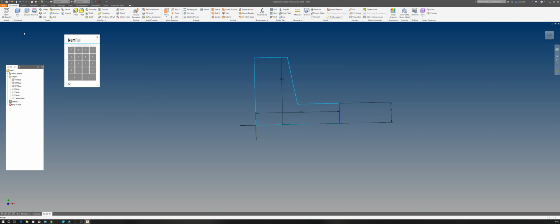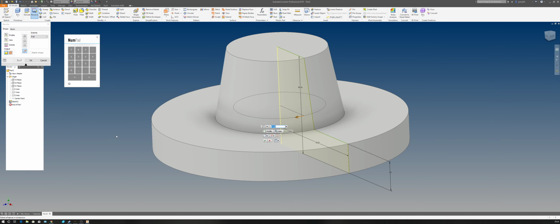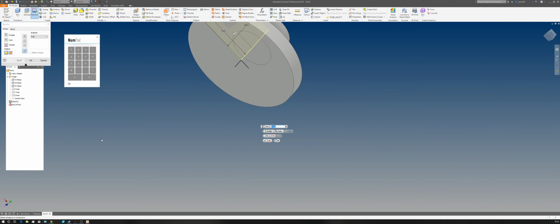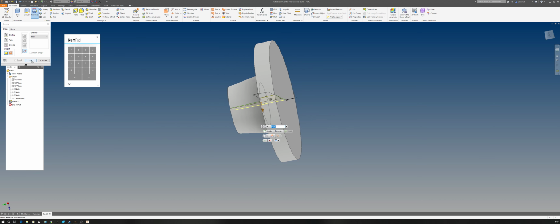And now we go into the 3D modelling bit. So, here we go. This is where we get all this. So we want to revolve this thing. So we press revolve and see how it's lit up. Now, that's the profile, which is that. The axis is that. I want to spin it round this axis here. And see what it does? It spins it right round like that. So that's the rough shape of a flange on the pipe. So press OK.